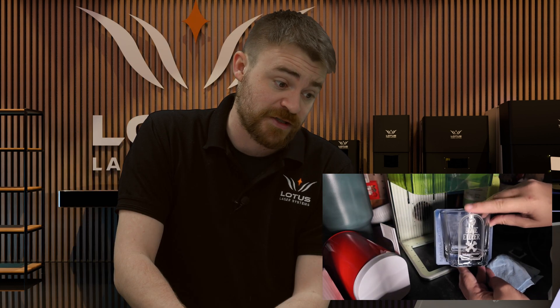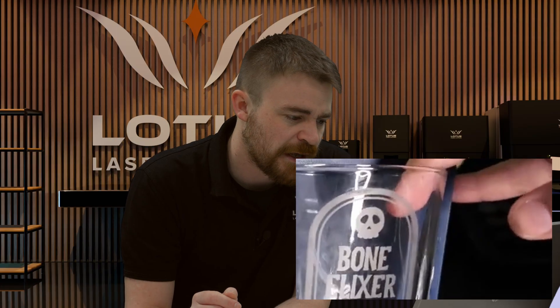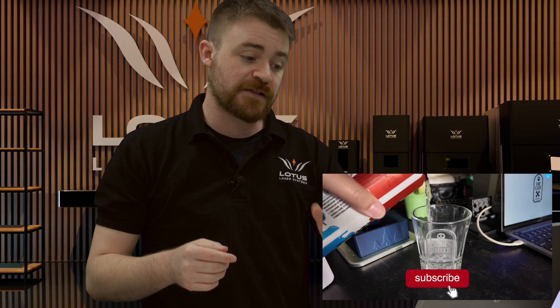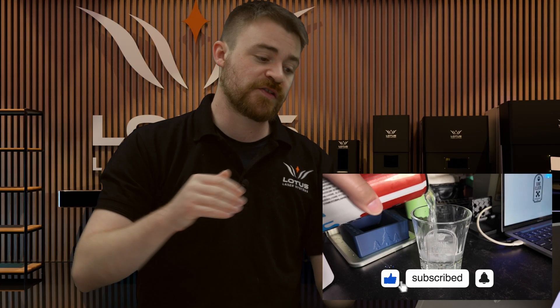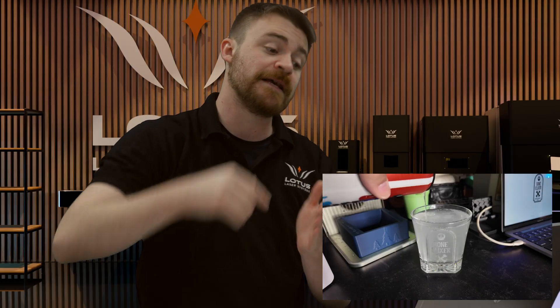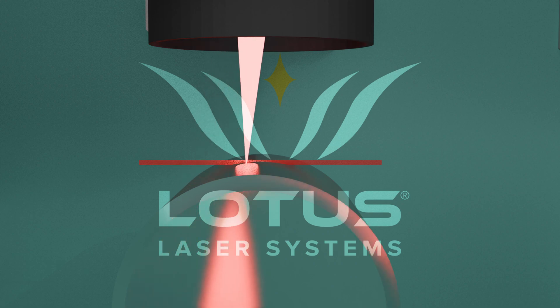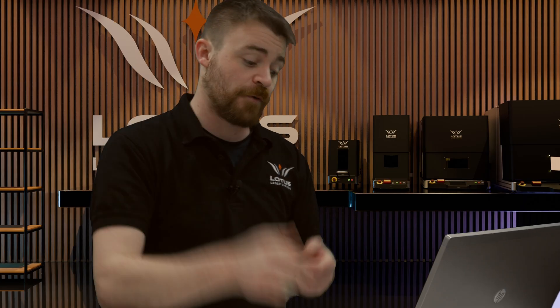It's not bad at all, actually — that's gone on a lot better than some of the other videos I've seen. It still is a little bit patchy though. You can see at the top bit where it hasn't quite taken. That could actually be a 3D issue: this glass slightly tapers upwards, so the focus height will have been set to the middle of the glass. When the laser gets to the bit closer to the scan head, the focal height would have been thrown off, so the laser didn't have enough energy to react with the paint.